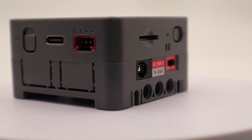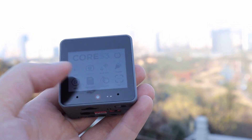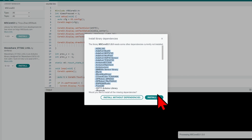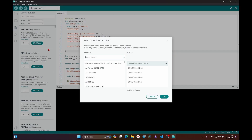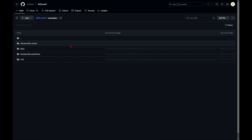Now that we covered the hardware, let's talk about how to program it. The Arduino IDE — the timeless classic. In the board manager, we need to install the full package for the Core S3. We connect the device to the computer, select the COM port, then select Core S3 and start exploring and modifying the examples. On the GitHub link in the description, there are sketches for working with the mentioned sensors. You should go through them and then combine them to solve your tasks.